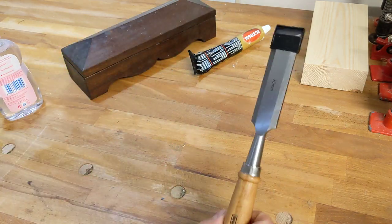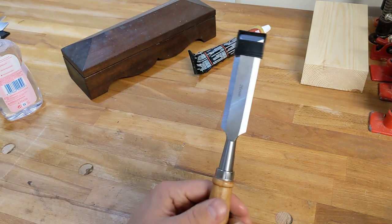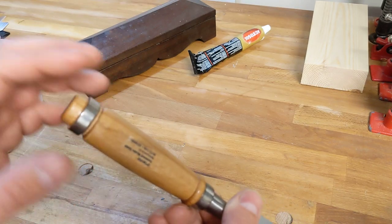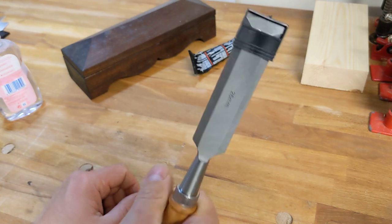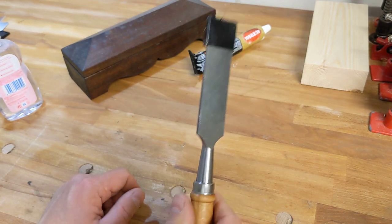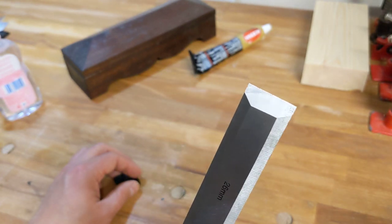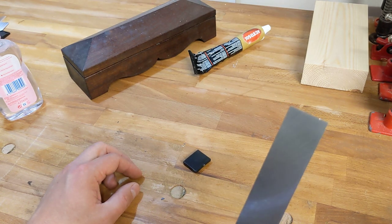We'll take a look at the 25mm one first — or the 26, because you get a 26, an 18, a 12, and an 8, which for doing some beginner stuff should be just fine. Handles are in beech. There's a ferrule on the end which is a little bit loose fitting, but once you tap on it a few times it'll start to mushroom out and grip. There's a ferrule at the bottom too. The handle's a little on the small side — if you've got really big hands it might feel small. The bevel looks square enough to me; I don't put a square on the end of it.